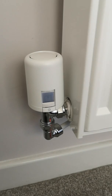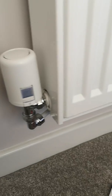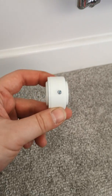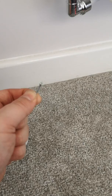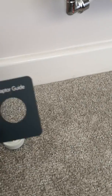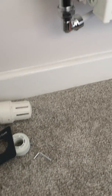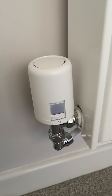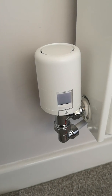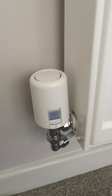The next part is all done through the app — you just need to sync it up to your Hive account. With this one I've only used the one adapter, so the one with the Allen grub screw isn't going to be used, and likewise I don't need the Allen key. The adapter guide was useful for the installation. You can keep the old TRV head if you want, but your Hive radiator valve head is going to be doing that job now. The next process is to go through the installation on the app — it'll ask you to do a calibration as well, which I can put another video up of. Thanks for watching.